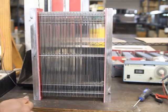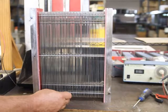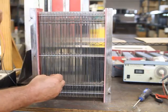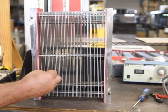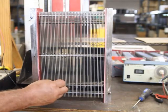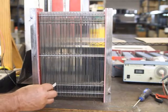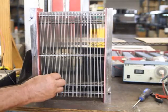We've got the cell turned over. We remember it was happening about ten plates over and about four and a half inches up — right in this area here. We're going to take an emery board and lightly file along that tenth cell plate, and the eleventh one as well, just real lightly. We're trying to get rid of the burr that was causing that to happen.